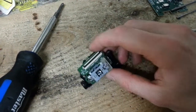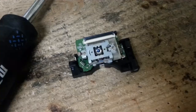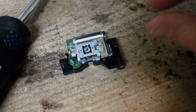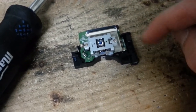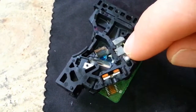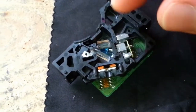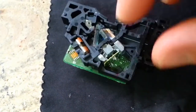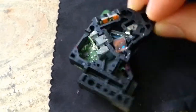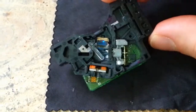Here I have successfully removed the optical sled from the optical drive as well as some other additional components. The next step is to start tearing this down carefully. Before I start disassembling the optical sled, I want to make sure my workspace is free from any static electricity, as just the smallest amount of charge could destroy some of the precious components. Here's the optical sled with the cover removed — we have one laser diode right here, which is actually a multi-mode laser diode consisting of red and infrared wavelength radiation, with three pins that we can remove. Over here we have optical components such as a mirror, some filtering, and other optical components that we can scavenge.